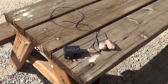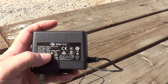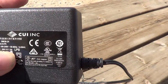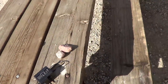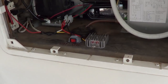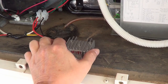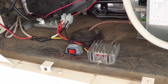So this is how I solved it. This is the little wall adapter that came with the Connect — its output is 24 volts DC at 1.5 amps. To solve it I used what's called a DC-to-DC converter, and that's what this little device is. It takes 12 volts from your battery power and the electronics inside spit out 24 volts, which is the proper voltage to run the Wi-Fi Connect.